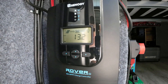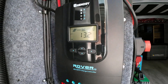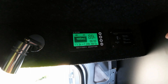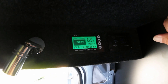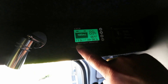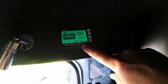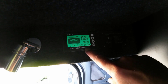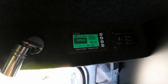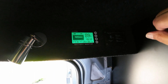Let's check what our battery monitor is doing up front — hopefully that's happy. The battery monitor is flashing, letting us know that a charge is coming in. You can see the up arrows; batteries are sitting at 13.3. We're bringing in about 7.3 amps and about 98 watts, sitting at 89% power. If the sun stayed where it is, it would take about six hours to charge. Everything is working!